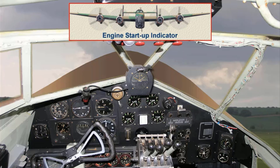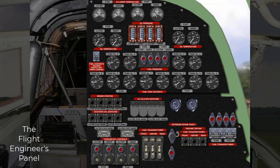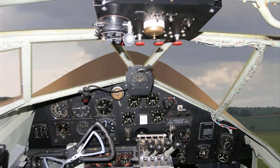Comprehensive checks should be carried out after repair or at the pilot's discretion. Open up to 1500 revs per minute and exercise and check operation of the two-speed supercharger. The oil pressure should drop momentarily at each change, and the revs per minute should fall when S ratio is engaged; return control to M ratio. At plus two pounds per square inch boost, check the operation of the constant speed propeller, then return the lever fully up. Open the throttle and check takeoff boost and static revs per minute, which should be 2800 at takeoff boost. Throttle back until boost is below plus six pounds per square inch and a slight drop in revs per minute is noted. If all is well, it's time to taxi the aircraft.